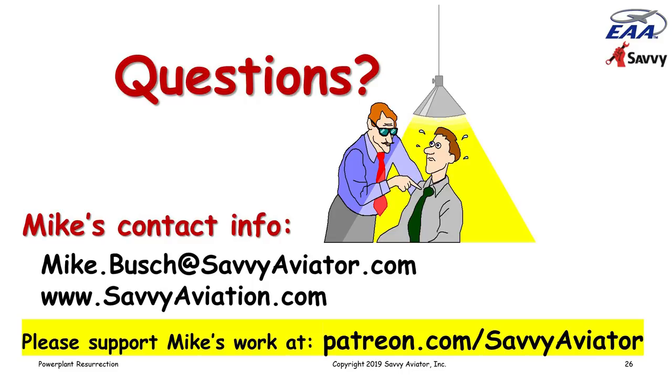It's really an unanswerable question because there are so many factors involved. If the airplane is sitting in a hangar in Tucson, Arizona, it could probably sit there for 20 years and still be okay. If it's sitting in South Florida, it might be toast after 6 months. There's so much variability in terms of environmental risk as to where the airplane is spending its inactive time. There are also issues of whether the airplane was hangared or not, and whether it was using oil that has corrosion preventative additives in it, or something like CamGuard, which will help inhibit corrosion and will allow the engine to sit for a longer time before damaging corrosion sets in.